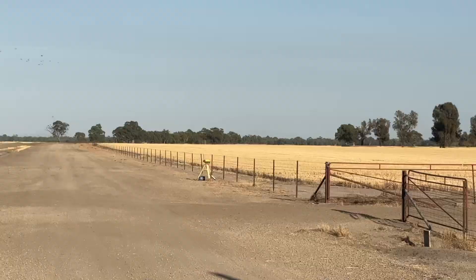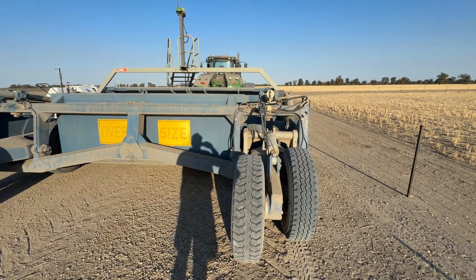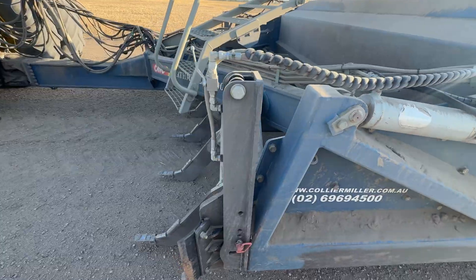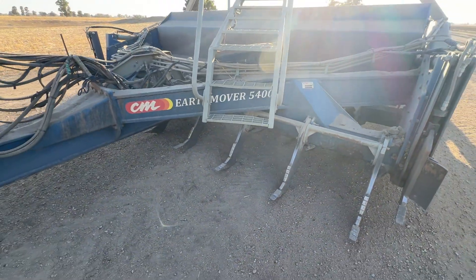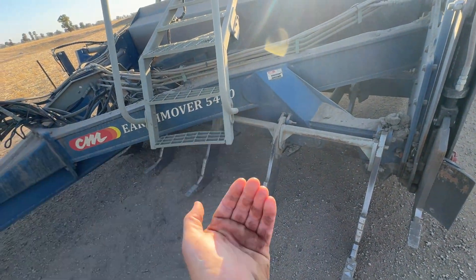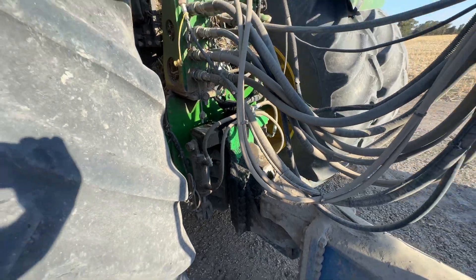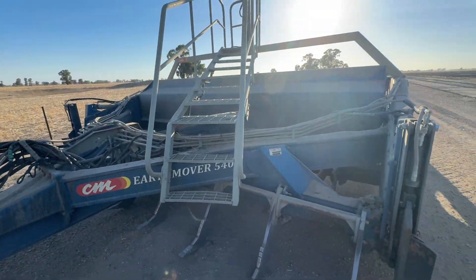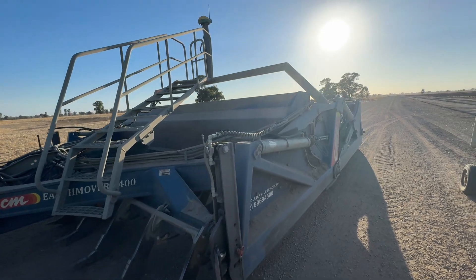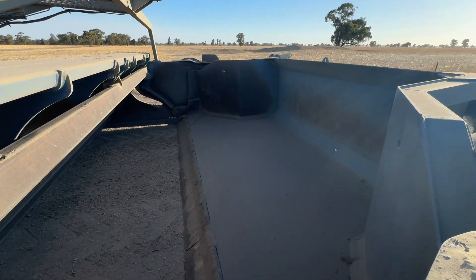That's my base receiver over there - it's got to be close to the job. There are two walking beams in the back plus a cross-slope control, so it's always at zero percent or trying to get to zero slope when it's out in the bay. You can do any digging passes - you generally have to rip, so that's what the rippers on the front are for. The machine also has a ball and cushion hitch system just to help with the ride when you're crossing the paddock. What we're going to be doing today is cross grading or regrading and we won't have to do too much carting, but we will do a little bit.